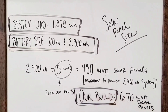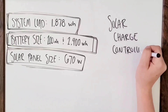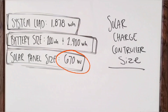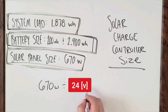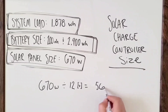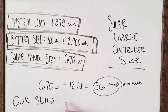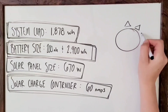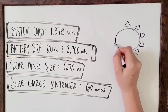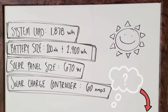Determining charge controller size: divide your total solar panel wattage by 12, or by 24 if you're on a 24-volt system. This gives you the minimum amp rating for your solar charge controller. In our case we're going with a 60-amp MPPT charge controller. If you made it through this math section without crying, give us a thumbs up — and if you didn't, we're very sorry. Leave any questions in the comments and we'll do our best to respond.